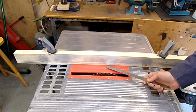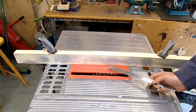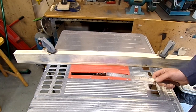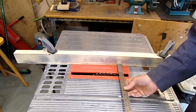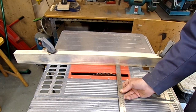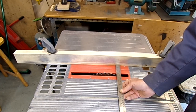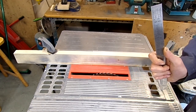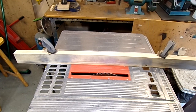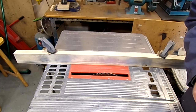I've set the gap from here to the edge of the blade just over two and a half inches. As the strip is five inches wide of ply that's supplied for the tailplane, that'll give me one piece just over two and a half, which is what I need for the spar and leading edge block area top and bottom, and the remainder of the strip will be just over two and a quarter inches, which is what I need for all the other gussets. So I'll trim the sheets and then get on and do the rest of the gusset making.